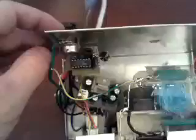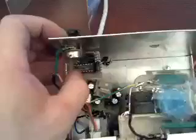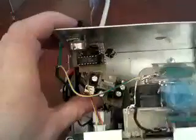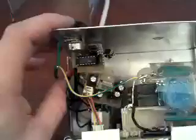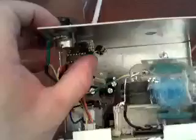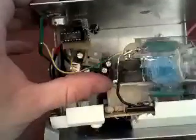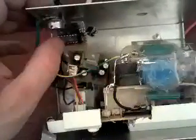You can see here I have the pulse width modulator board, which I made and described in my previous video. It's based on a 556 timer, although you can use a 555 — I'm only using half of it, but it's what I had sitting around. It just produces a pulse train that ends up on this yellow wire here and controls the output of the inverter. This unit here is a 5-volt power supply I ripped out of some old thing, and it provides power for the pulse width modulator, because there's no easy way to get a DC voltage that's line-isolated out of the inverter board. Everything on there floats at line potential, so you just have to have a separate power supply for your pulse width modulation.